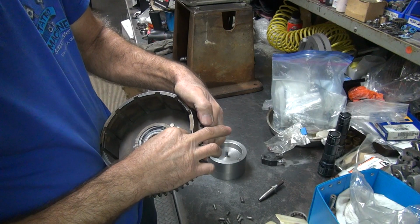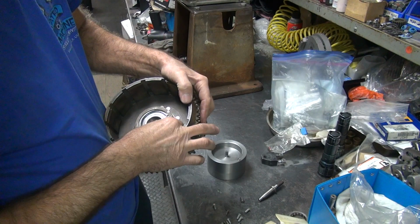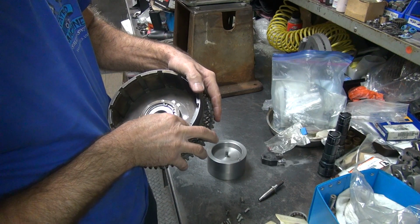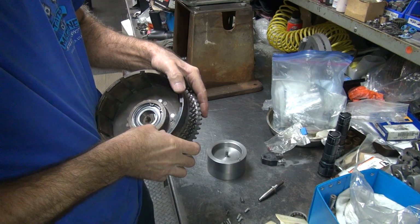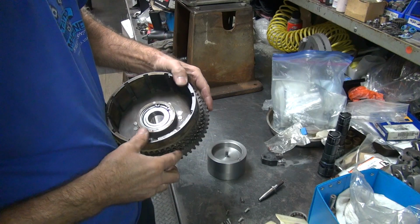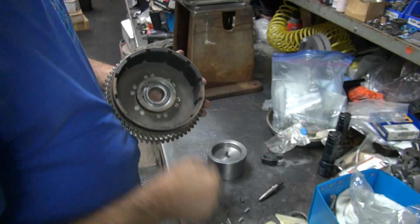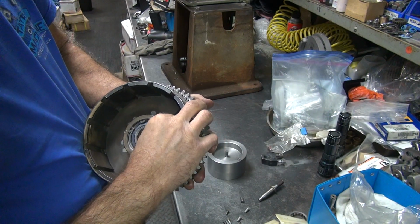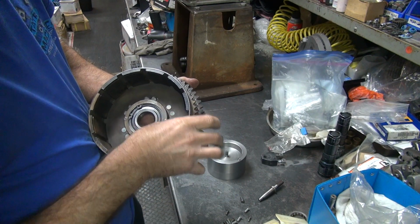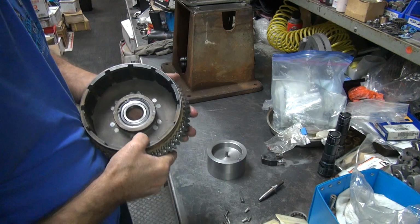And so these rivets all stuck up above the surface before I countersunk it, and made things match up better. These things get cut oversized, they kind of screwed up a lot of stuff. Damn, that one goes in hard. See, they drill it from several different places. It's not even, you got a couple different holes going there. A couple of these holes are pretty crappy. But it's alright, the rivet should crush in. We'll find out though. These don't work, we'll try some different ones.